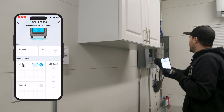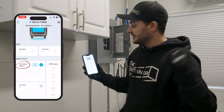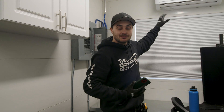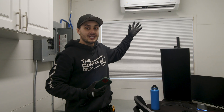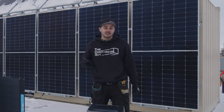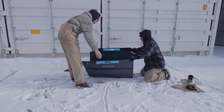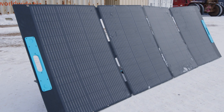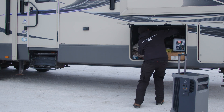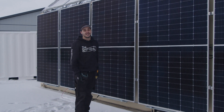If I turn off the baseboard heaters and run the mini-split unit instead — it takes a while to spool up but it'll get to about 900 watts, running for about two and a half hours. So I can get double the longevity out of running my mini-split heat pump, and it's pumping out 50% to 100% more BTUs than just burning an electric baseboard heater. We've run this down to 70% — it can be charged with either 1,800 watts by plugging it into an AC outlet, or with up to 2,400 watts of solar. There's a 400-watt foldable panel option great for RV underbelly stowage, and if you have a home solar array you can plug in regular 540-watt panels — four of those would charge it in no time.